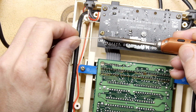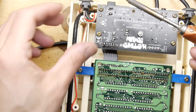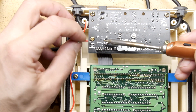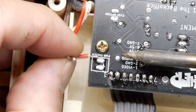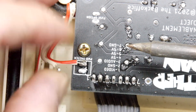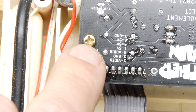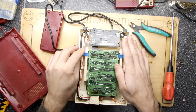This corner is where the power switch goes. I top-solder it — you can poke the through-hole components through normally, or just do what I do: solder from the top, then bend the leads over and run them parallel. Apply a tiny bit of heat for just a second — boom, they're in. Don't dwell. The second one is done. Just check they're not touching each other, otherwise the unit will be on permanently.